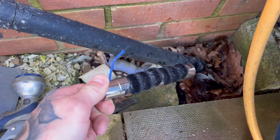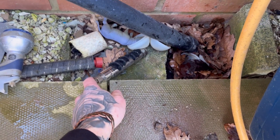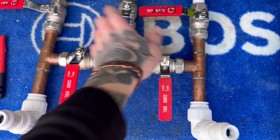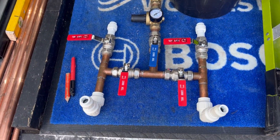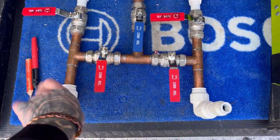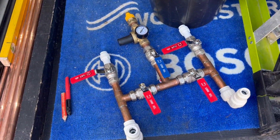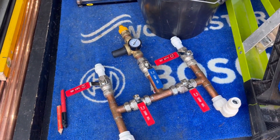You can see which side the hose pipe was in — that's pretty successful. Obviously it wasn't the most filthy system — you could tell that with the filter when I took it out — but I just wanted to demonstrate how this all works. I think it's better than just a standard mains flush around the flow and out the return. On a mains flush on the boiler you could attach a MagnaClean to this quite easily, on either side you wanted to put it on or just on one of the dump hoses to see what it's picking up — that's another option, might do that as a video in the future.